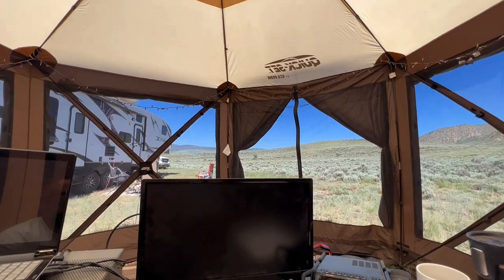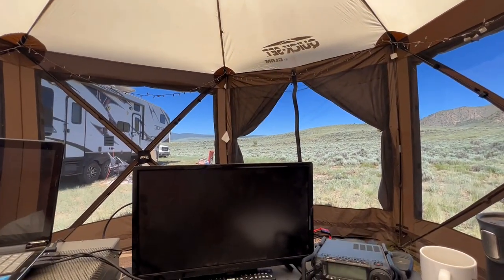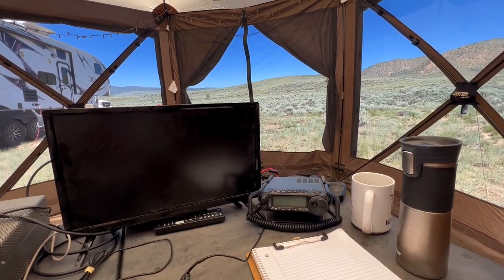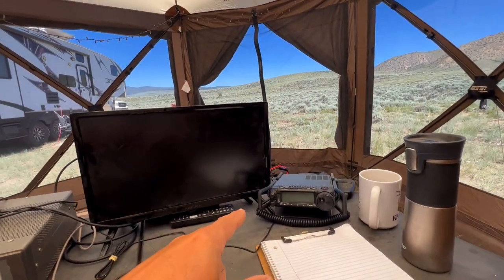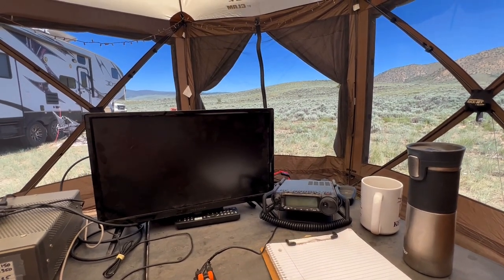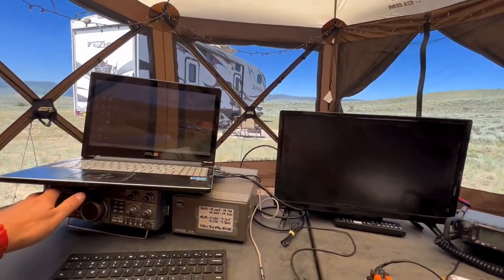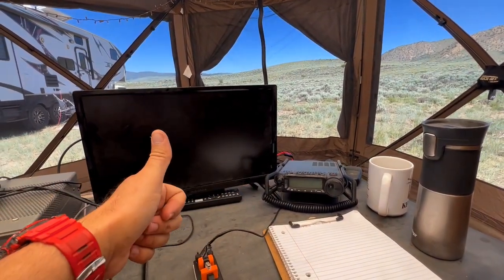Each antenna is about 100 feet apart — that one's on my 100-foot coax. So 100 feet apart, reverse polarity, five watts max power out of both. I tested this last night and was able to run FT8 without picking up extra noise on the FT-891. At first I did, but I had it running way too powerful — about 20 watts — and the bandwidth was really wide; it defaults to SSB width on CW mode on the FT-891. I was getting about an S6 or S7 noise when I ran the tune function on FT8. Once I got the power down on the Kenwood and the width right on the Yaesu, everything was good.